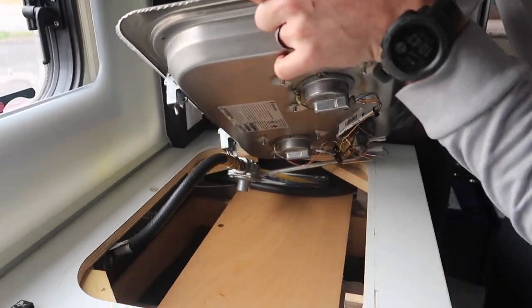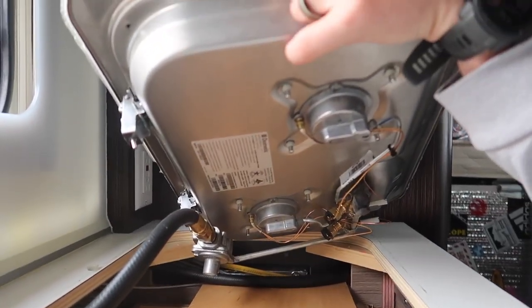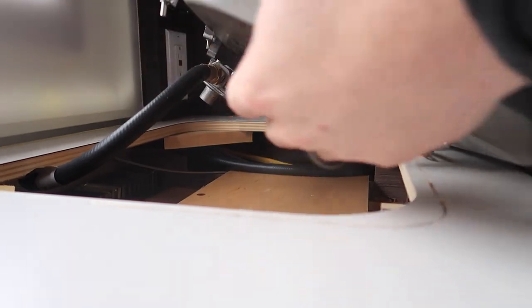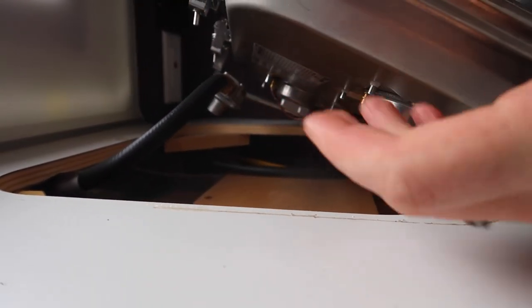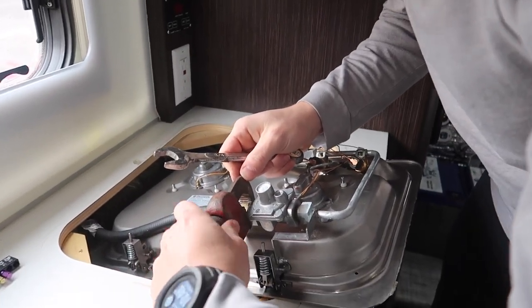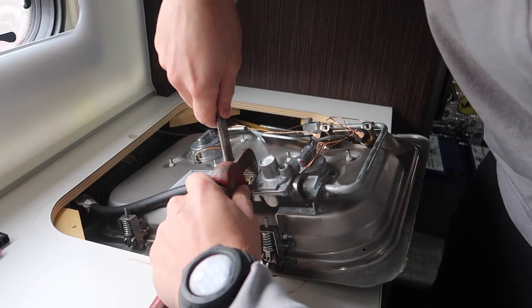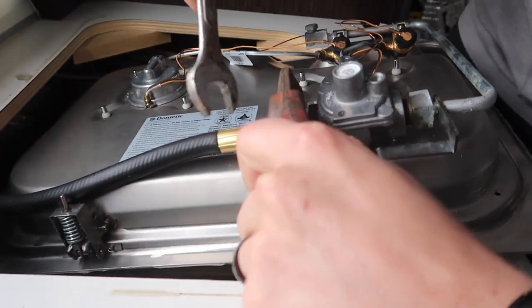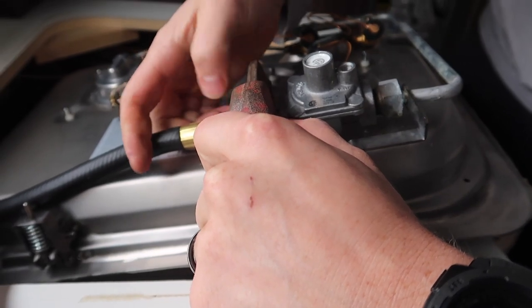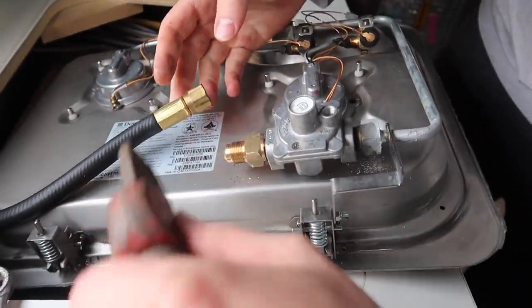Remove that, and as you can see there's a propane line. We don't have propane anymore, so I'm going to get a proper wrench to remove this. It's pretty simple — you need one of these, a three-quarter inch wrench — and that's really it. The line is now removed.